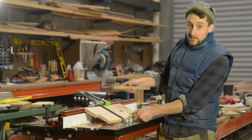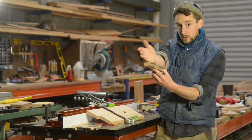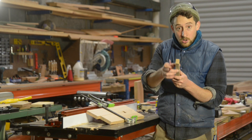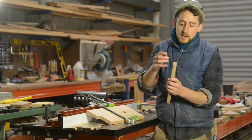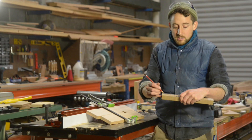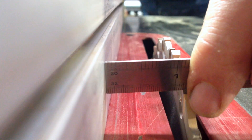I've set the height and depth of the router bit in the table, and this is the piece of stock I'm going to cut my butterflies out of. You'll notice it's actually a long strip of end grain — the grain is going this way, not longitudinally. The reason is that my little butterflies are going to be cut in that shape, and I'm going to have essentially a long strip of butterflies which I'll cut into the depth I need. I need the grain going this way because that is the direction the force will be applied to the butterfly to stop the pieces of timber from spreading. If the butterfly grain went the other direction, that would be a very easy way to split timber and it actually wouldn't be applying any strength to the joint. I've cut this piece to exactly 28mm thick — it's actually 28.05mm, which is just slightly smaller than the butterfly hole at about 28.1mm, so there's 0.05mm of difference, and hopefully that'll just slide in perfectly.